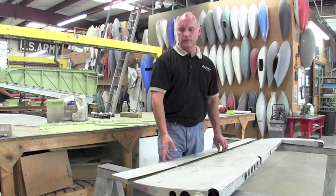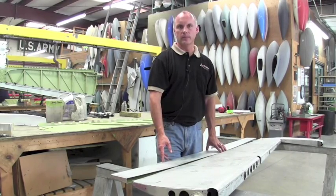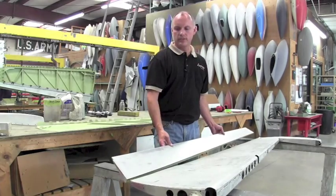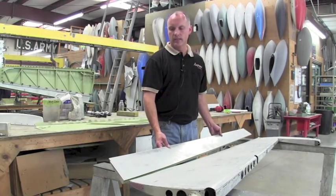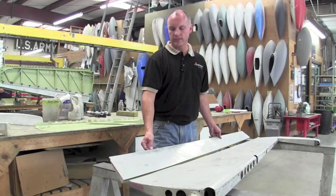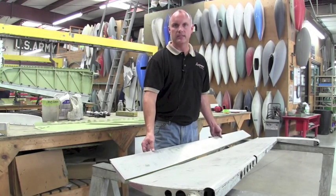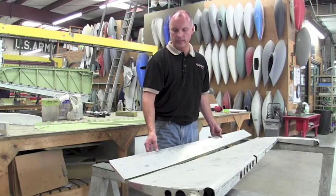The original foam trailing edge segment can easily be identified by rivets along the trailing edge. The new style trailing edge segment is a single piece folded-over skin with no foam core, and can be identified by just the bent skin with no rivets in the trailing edge.